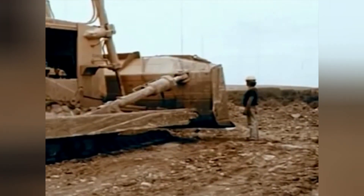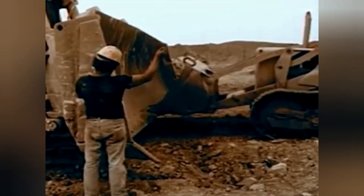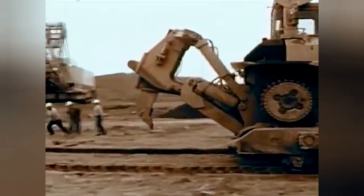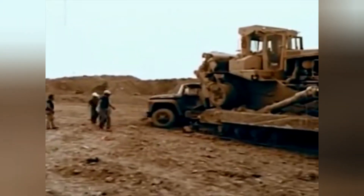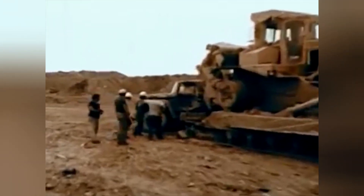They're about to push a high-sprocketed machine from an old set of tracks onto a new set. With both tracks removed, the machine is free to roll on a slight grade — it may just take off. If they'd had an operator in the machine, he could have stopped it by dropping the ripper or blade. They should have planned proper blocking and restraint, but better still, they should change one track at a time so there can't be a rollaway.